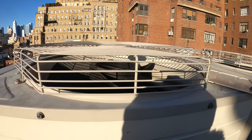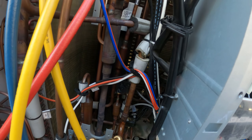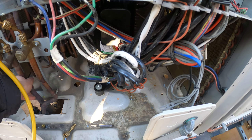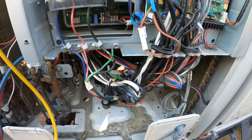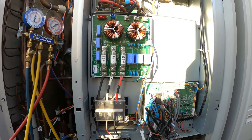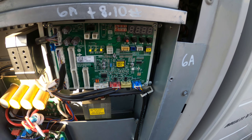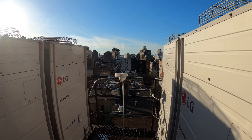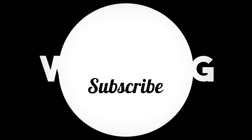I do have this a bit crossed up — I believe this is the suction line. Alright, we got 24 pounds and 9.3 ounces; looks like it's not really going to take any more. So I'm going to have to use a little bit of this tank just to finish it off. Alright, compressor is running, got proper charge. That line is cold — that's good. No error codes. The only thing is the condenser fan motor is not running, but that might cycle off on some sort of thermistor if it gets to a certain pressure and temperature. Looks like everything is good. Changing the compressor and inverter board was definitely difficult and a pain, but it is what it is. If anyone found this video interesting or helpful, please drop a like, comment, and subscribe as I come out with new videos every week — catch you all next time.